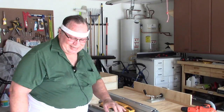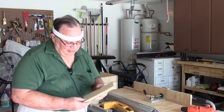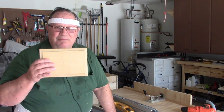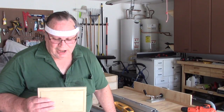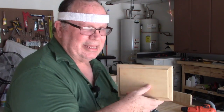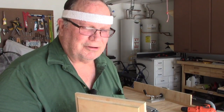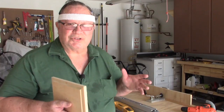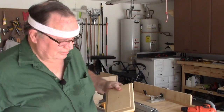When I last left you, I was putting on my drawer front panels. When I put this one on and closed the drawer, I could see there was just a slight little edge of light shining through there, indicating that my drawer cover was too low. I thought I'm going to have to raise the drawer slides up about a quarter inch to get these things to cover the opening the way I wanted. I thought I'll wait to do that another day.